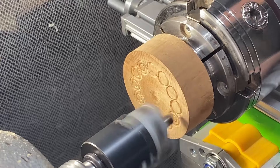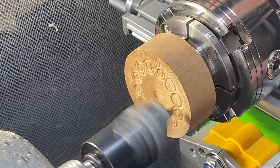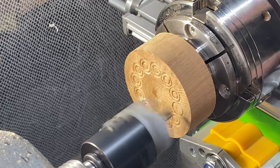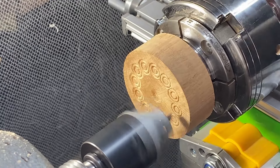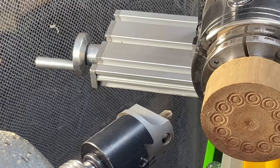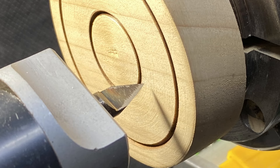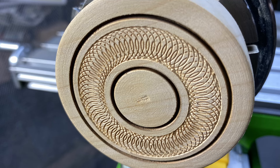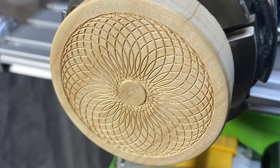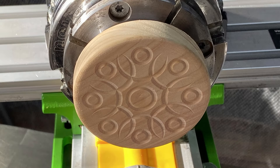This is the very first item I'm doing on the jig. I've done a series of circles and then shortened the radius down a bit, putting a circle inside those circles. That tool with the really wide angle is good for chewing out a lot of wood but it doesn't provide fine detail. So for the second drill bit I chopped it down and ground a very acute angle. I ran some more and took photos afterwards — and that's how those ones came out, which I think were pretty good.